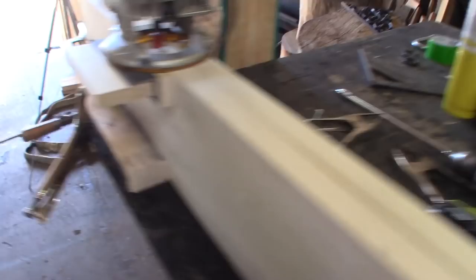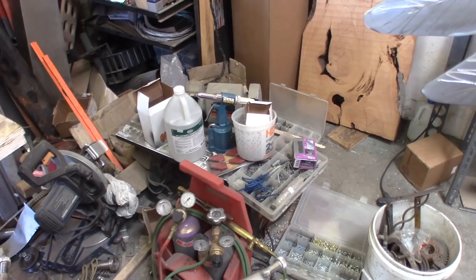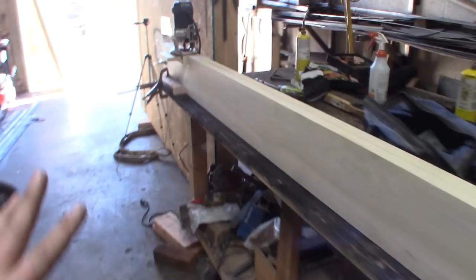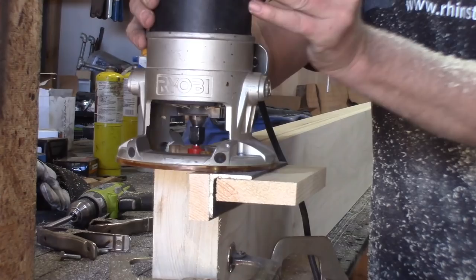In order to keep it nice and tight, I've clamped this two-by-three to the boards and then clamped the two-by-three to the wood. Clamping this together means it shouldn't move — both boards together give me a little bit wider surface to land the router on. Now believe it or not, I do have a router table — that's my router table. I don't often use it; it makes a great flat space to store a bunch of crap, which it's doing a really good job of right now. But with a router table like that and my skill level, I don't want to run boards of this size down a puny little router table. I had the edges squared at the wood shop where I buy my wood.